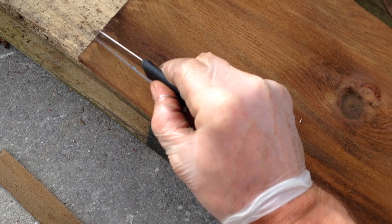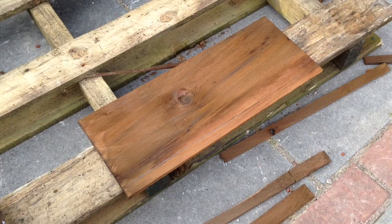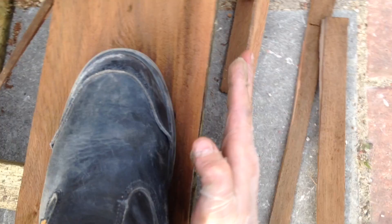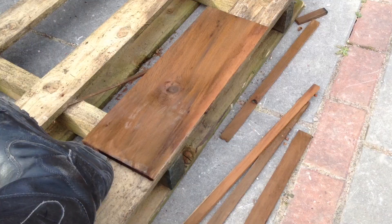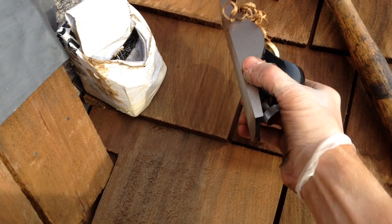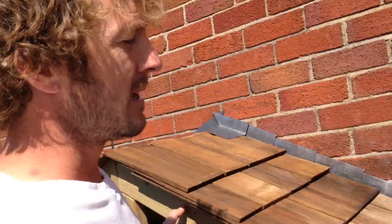Basically you just go along the line and score the shingle. You're not aiming to cut through it, you just want to leave a line along your pencil line. Run over that line a few times. As is true with many materials but especially cedar shingles, creating a very thin line like that acts as a stress raiser. Then all you need to do is place the shingle on the edge of a batten or a pallet and break off the shingle along your line. If you need to remove more than a couple of millimetres you can use a simple hand plane. These shingles are very soft and a real pleasure to work with. Once the shingles on that row are finished you're ready to place another lead soaker and continue with the next course.